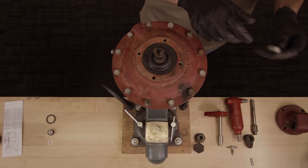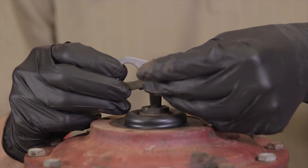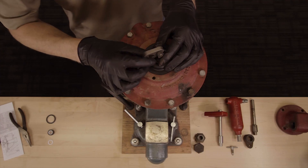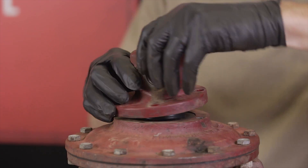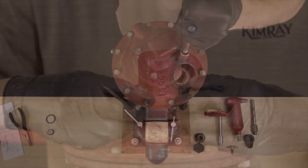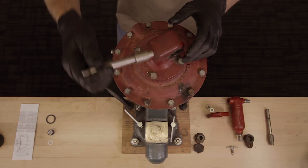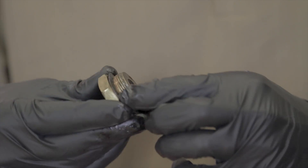We will be installing the new hub design to replace the old version. Make sure the flat side of the link hub is at the bottom. Insert the pin through the stem and hub link and secure it with two new snap rings. Lift the link hub slightly and place the bonnet over the stem assembly and onto the stem diaphragm assembly. Align the bonnet with the direction of the valve inlet. Tighten the four bolts in a criss-cross pattern to avoid misalignment. Grease the shaft and insert the thicker end into the bonnet opposite the side of the equalizing pressure port. Apply grease to both sides of the new gasket and install it on the plug, making sure the gasket rests against the shoulder of the plug. Then tighten the plug with a wrench.